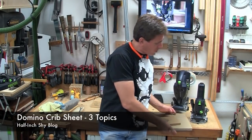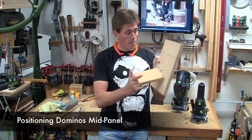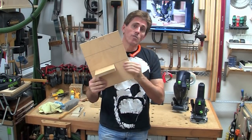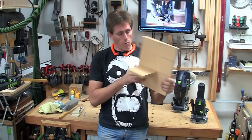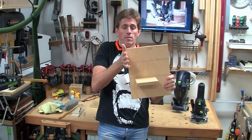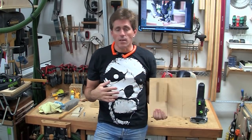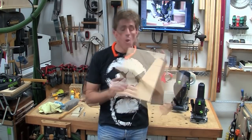The type of joint you may wish to make is one where you've got a side piece and a shelf, and you'd like to domino that shelf right into the piece and have it line up with a line that you've scored on there. When you mark a line on a board like this, you don't have any reference surfaces to go off — no place to put the fence — so you've got to use a different technique. It's very easy to do, and I'm going to show you two different ways.